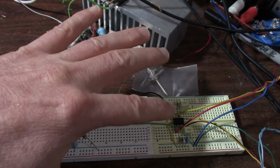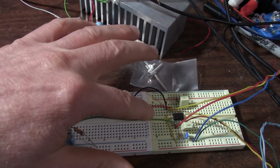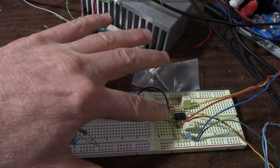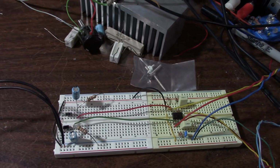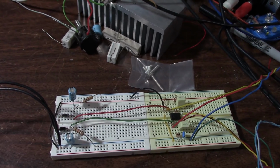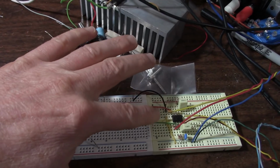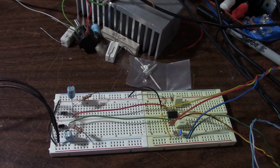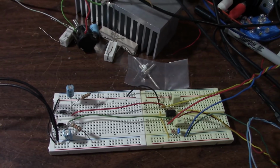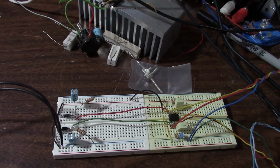I would set the gain as minimal as I would need for the circuit to keep noise levels down, and I would probably select a higher end or a newer, higher performance op amp, depending on whether money factored into the situation. And that's another thing. Those higher performance chips do cost more than your Jelly Bean NE5532, so that comes in. But if it were me, I would certainly choose a newer high performance op amp.